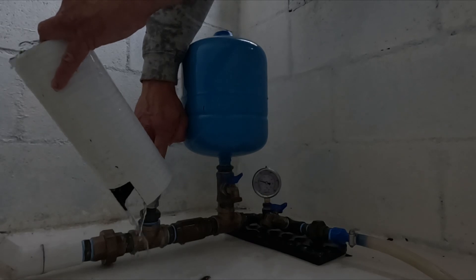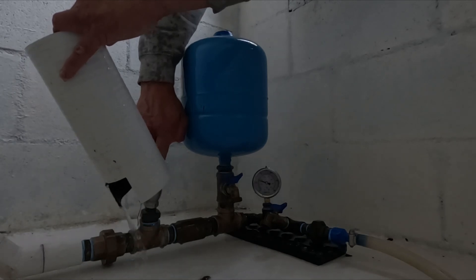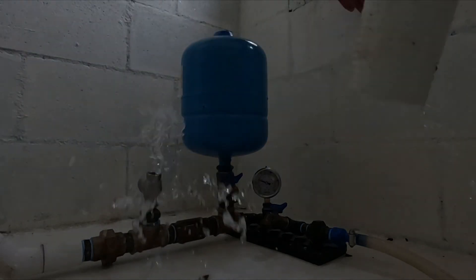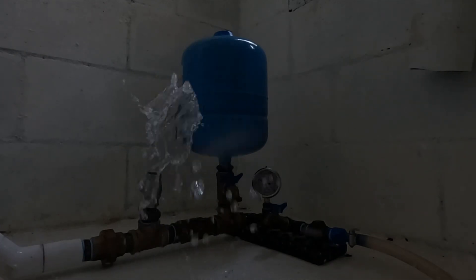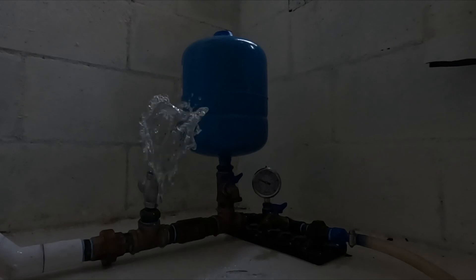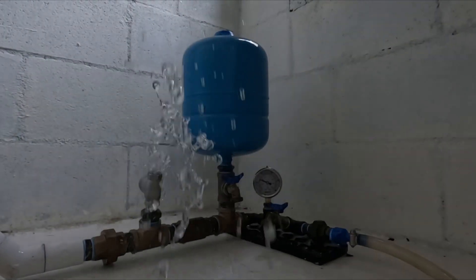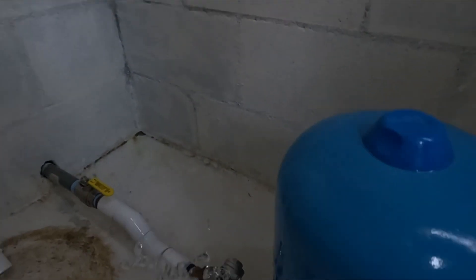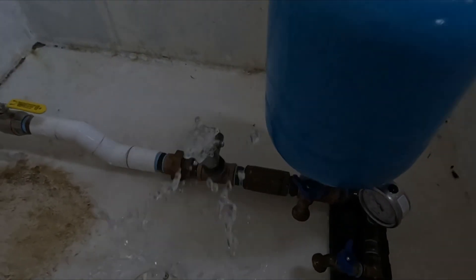What I'm doing right now is just holding the valve open to eliminate any air pockets in the drive pipe. You can hear that uneven rhythm to the actual cycling of the pump, and that means there's some air trapped in the system. It's always fun working on the ram pump — you usually get a shot of fresh mountain spring water straight to the dome. But now you can hear the ram pump is cycling to a standard rhythmic beat.